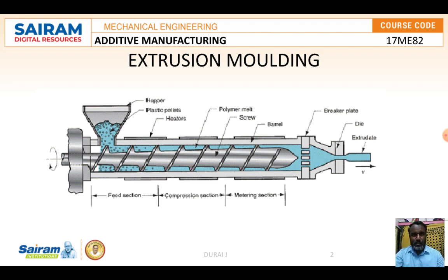Compound plastic material is fed through the hopper as either powder or granules. The powder or granules enter the cylinder which has provision for electrical heating. The heaters are provided there and with the help of that heating the material gets softened. The hot plastic charge is further worked through the cylinder by a helically revolving screw.